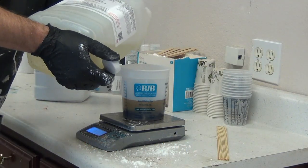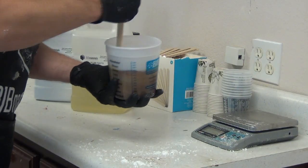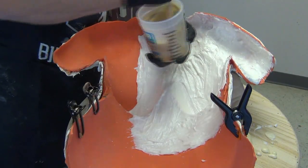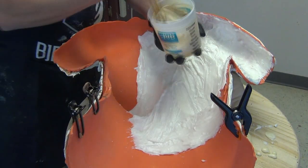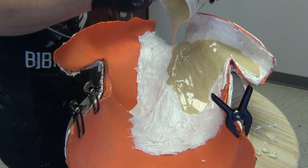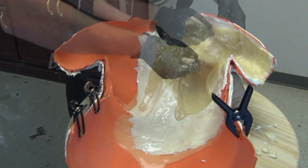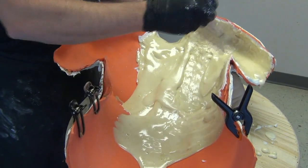TC300 is a rigid expanding foam that expands about 10 times the original volume and is six-pound density, so it has a nice low-density wood-like feel in the end product. Much like the TC808, you want to move fast — get your resin mixed up really well, then dump it out in the mold. I'm going to use a throwaway brush to push that around the resin surface. Rigid foam has a slower expansion rate than flexible foam, so I have a little more working time to get it spread out and distributed across the back of the resin. Brushing that across the back of the foam ensures I don't have any gaps behind it that could create distortions.